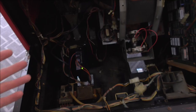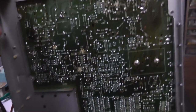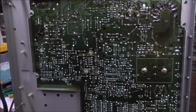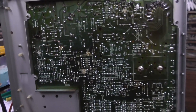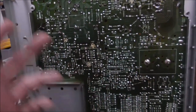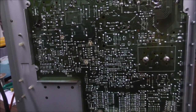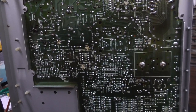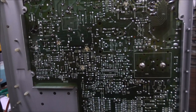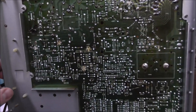Now we're messing with the other one — the one that was sparking and making us think we were going to die. We pulled out the one they rebuilt and looked around. We can't find any bad solder and didn't notice any caps that were in backwards. That snapping thing it was doing only happened a couple of times, so we're still watching it. It does have a new flyback. Joe checked the B+, and it's at 75 volts — it should be 110. We're definitely low.